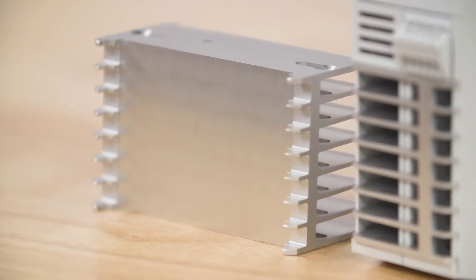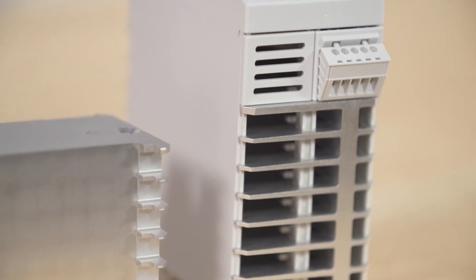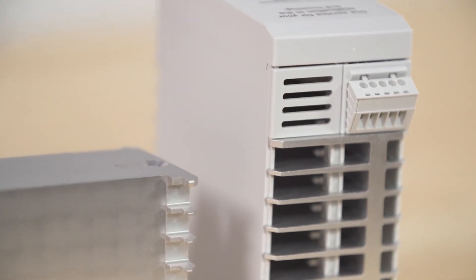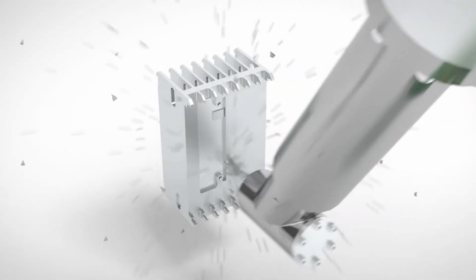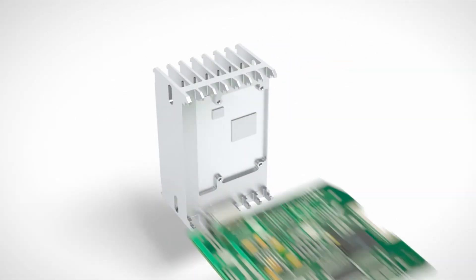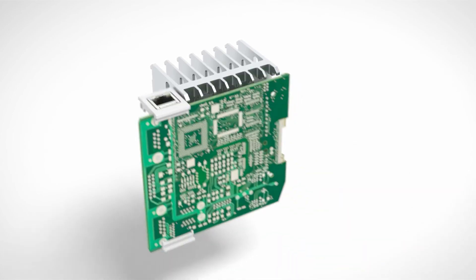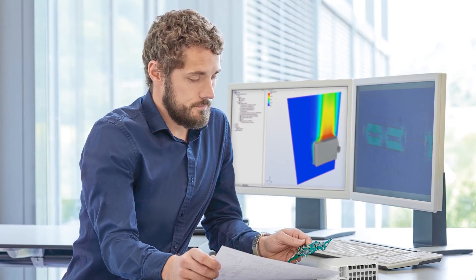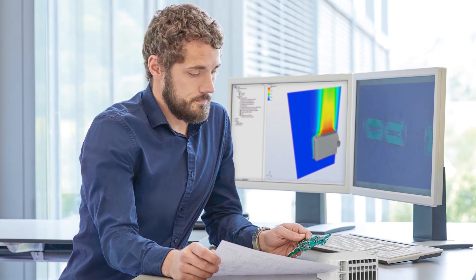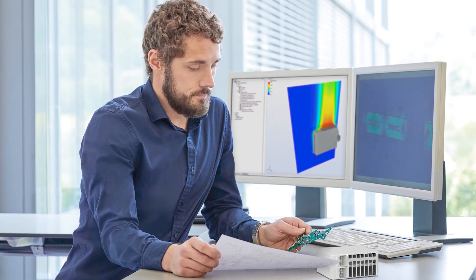The ICS is available with integrated cooling elements, heat sinks, as well as venting, to support the overall effort of heat management and dissipation. The integrated heat sinks are easily machined to match the profile of the hot spot components to facilitate efficient thermal transfer to the heat sink and out of the device. Sometimes designs call for more in-depth thermal analysis and recommendations for proper heat dissipation, and if further support is needed, individual consultation is available for suggesting layout and packaging changes.